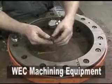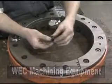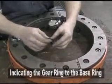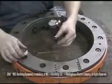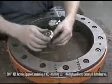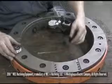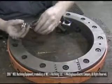Your adjustable bearing pins right here. You see where it's flush on one side and you have the adjustment on the other. When you turn the bearing pin, that adjusts your bearing in and out on your V-groove. When this is pressed on here, you turn this, it adjusts your bearing in and out, like that.